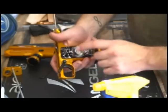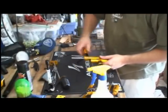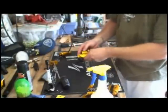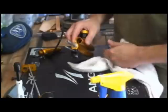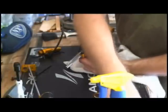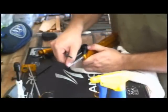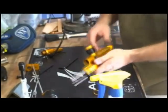This trigger is a little sticky — I'll show you how to take this apart in a few minutes and we'll fix that. Take the rag off, and you've got your basic body sitting there. Wipe it down. Get to all the stuff here. Wipe down the arms — those arms tend to get black. While they're in there, straighten these arms; those always get a little bit crooked. Get them straight and use the appropriate Allen wrench, which is a 3/16 Allen wrench, to tighten that back down. Clean those up and lubricate those, then put it back together. That should be about it once you've got everything wiped down.